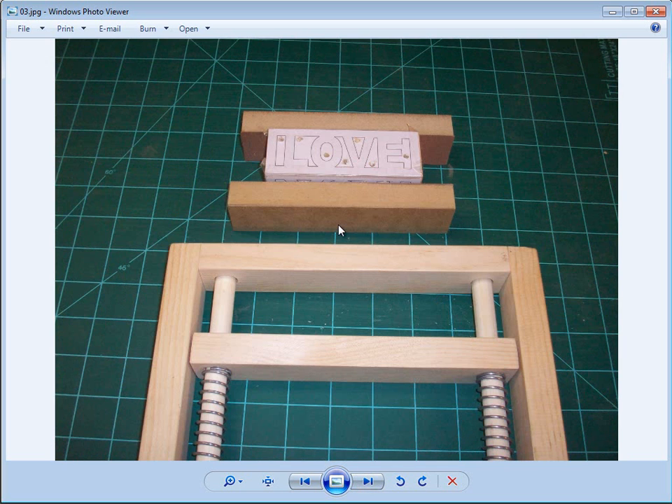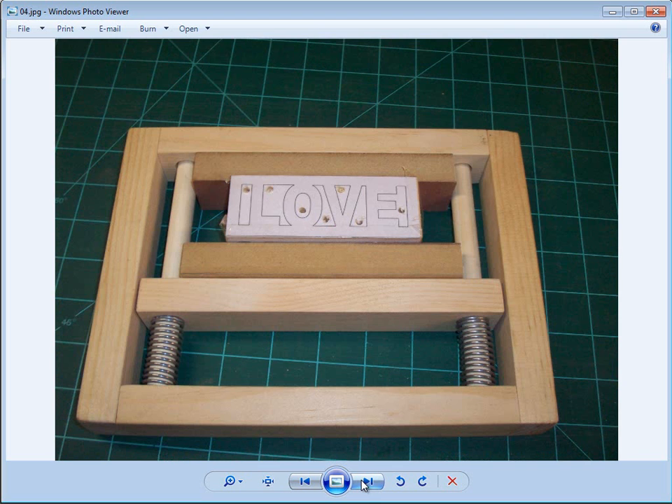To use this as a compound cut jig, you take your spacers with the sandpaper touching the wooden block you're going to be cutting, and go ahead and sandwich them in there. To put the pieces in this clamp, pull this crossbar back and then set the piece up over the spacers. It's a little bit difficult because your fingers want to get pinched right here, but after using it for a while I came up with an easier method for putting it on.